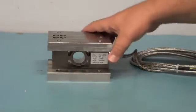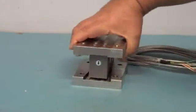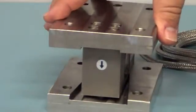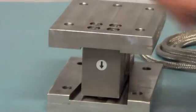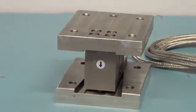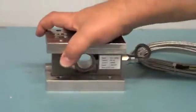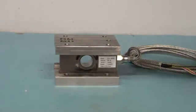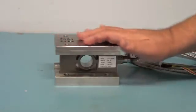You'll notice the V-groove designed in the upper and lower plates on the mounts. This channels water away from the load cell during cleaning. This particular model has a 500 kg capacity, and when four are coupled together, a capacity of 2,000 kg is attainable.